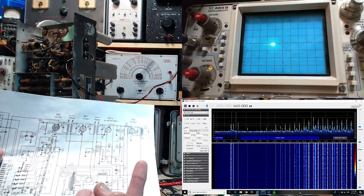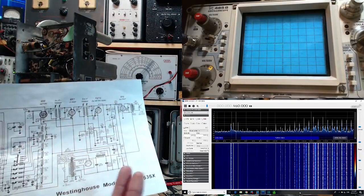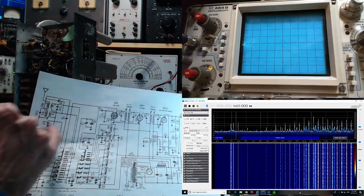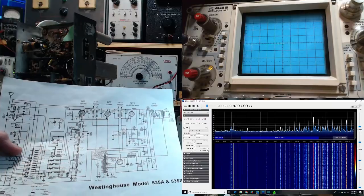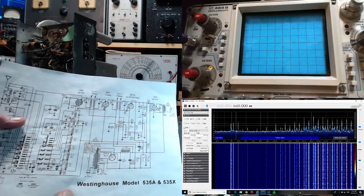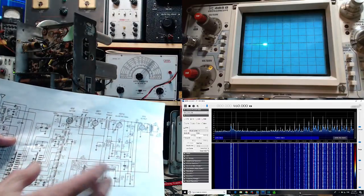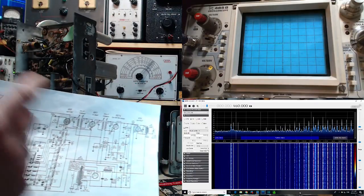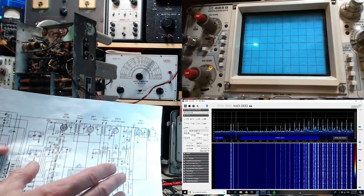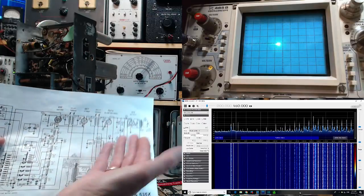One is the local oscillator, which is easy to pick up in various places in the radio. Another one is the front-end antenna tuning from the resonant circuits involved up here, which shows up — which is great. And the mystery is we appear to get something in the IF area. So if you look on the SDR, down around 460, there are signals coming and going. And as you saw when I clicked on those signals with the SDR and used it as a radio to detect and produce sound from them, it's the regular station we're listening to on the regular radio.